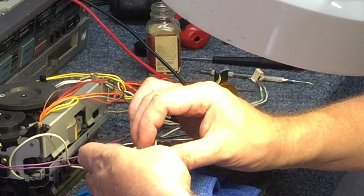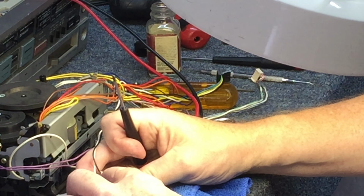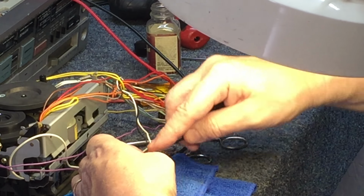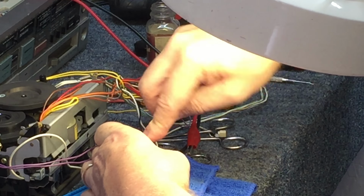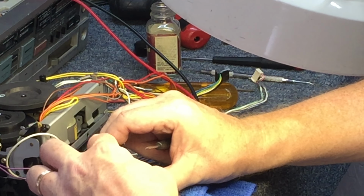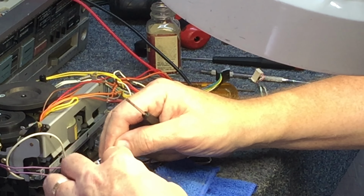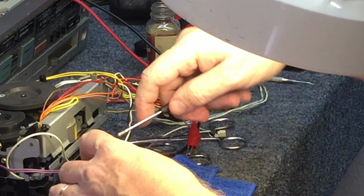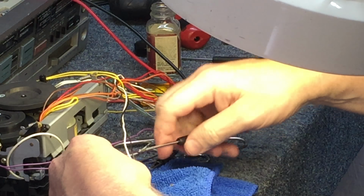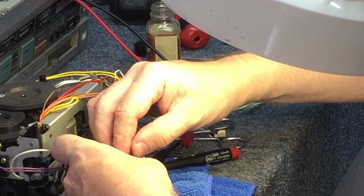It's off just a little bit, so let me see. See this part right here, if you can see that, it's not lined up over here. It's too far that direction, so I should still be able to pop it off. The way that I got it off before was I put a screwdriver underneath. Don't pry down on this. If you pry down on this in an effort to get the cap off, you're going to snap that off the board. So I stuck a larger screwdriver in here, then put a pair of hemostats across the screwdriver and used that as a fulcrum, I guess you would say, to pry up on it some. So now let's see if we can rotate this. I ain't going to be able to do it with it on there, so I have to come all the way off again. So, yay for me.